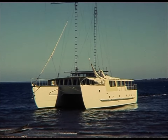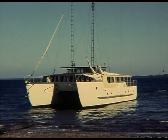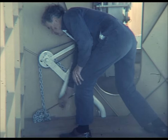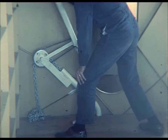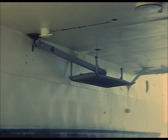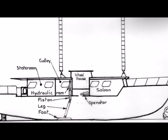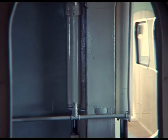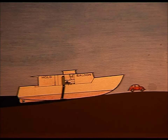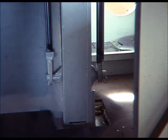We ran Linnay's ashore for the big test. The bows lifted up somewhat as she stopped and stuck fast. Using simple winches, I set about letting down the feet and legs. Once down, I kneeled under the wheelhouse floor to watch through a hatch and control the operation. With the feet down, I set the hydraulic rams going down, but I could only see the legs, the feet being underwater. Were they slipping or was the boat sliding? I couldn't tell.